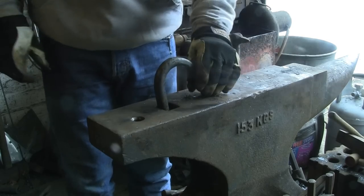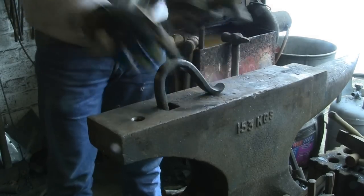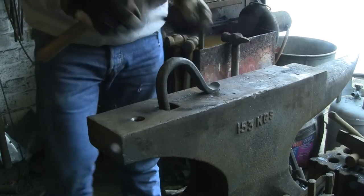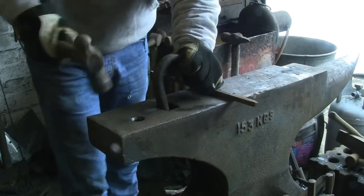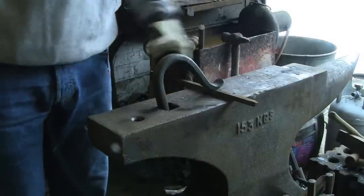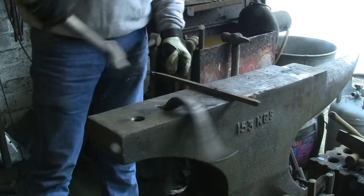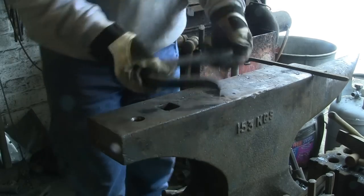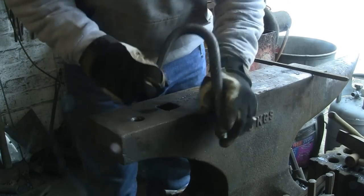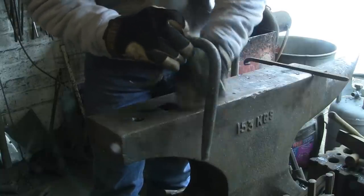Now I did what I did on my other video — with my folding knife — by heating it to yellow, or just over yellow, sort of orange, and quenching that bit out. And that's got that lovely and firm. That quenching in cold water gives it — yeah, look at that — rock solid. Tap it and it's free. The quenching gives it a bit of spring, but I still think it probably could have been a bit thinner at the top to give it even more spring — just up here, bring it a bit thinner.